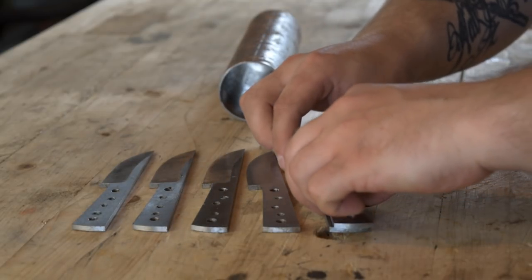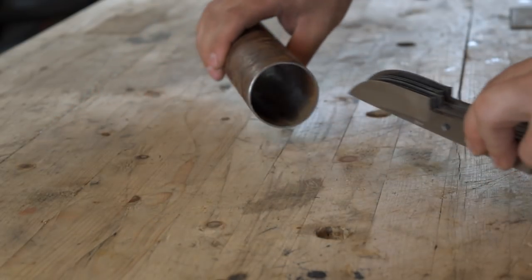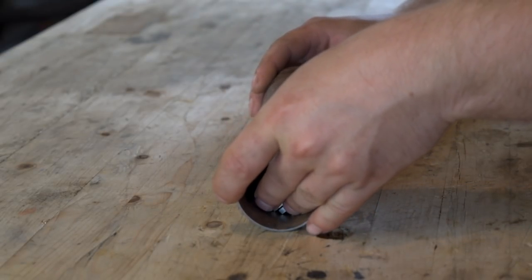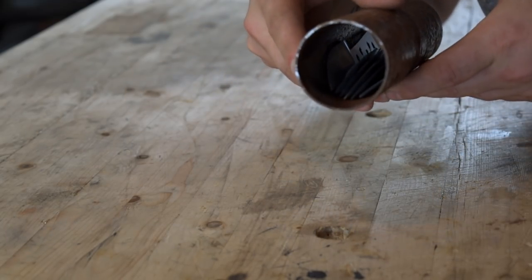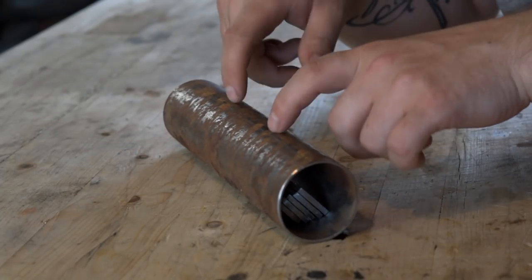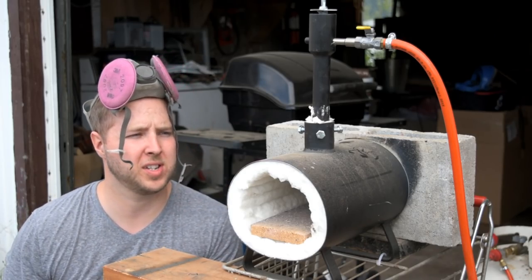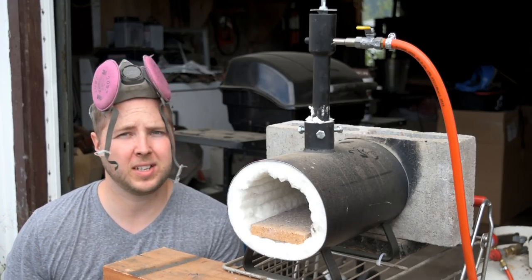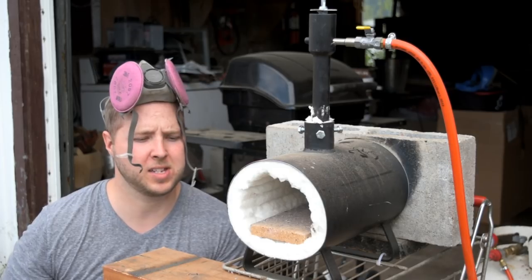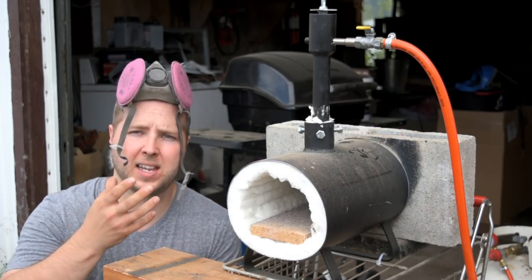Now with the pipe cut, I'm going to stack these blades. We can eventually take them out once they get up close to temperature and finish the heating outside of the pipe — we just don't want to take them from completely cold to 1,400 degrees Fahrenheit in two to three minutes. Having them all stacked together in this steel pipe creates a much heavier mass of steel to heat, with the flame heating the pipe from outside — much slower bring-up to temperature.